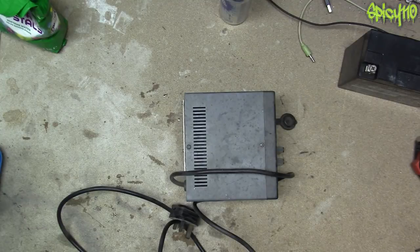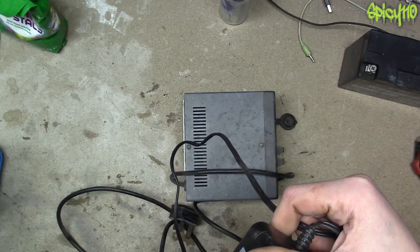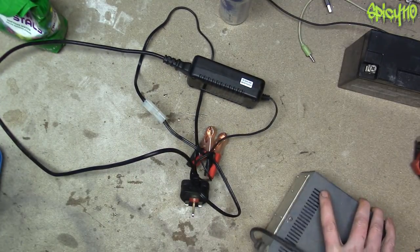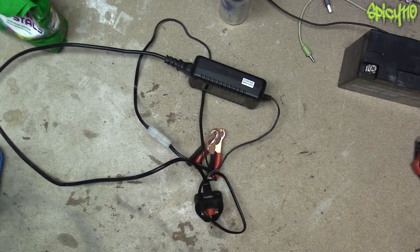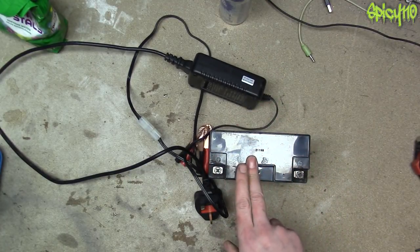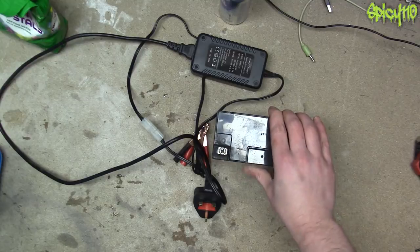The other way is using a charger. I don't have a car charger to hand but I do have the LexTech smart charger — output is 3.3 amps, much more like it. Because this is a smart charger, I'm not sure it would work directly. There is a way of getting around the smart protection features: you connect it to a battery, charge the battery, and then connect your leads from the electrolysis tank. So this motorcycle battery sits in the middle — the charger keeps it topped up and the tank runs off it.